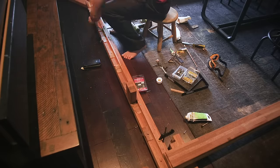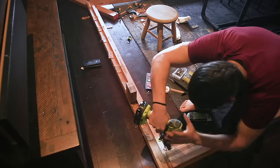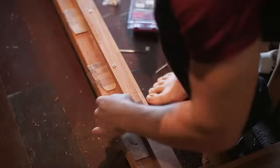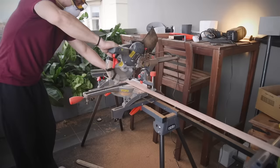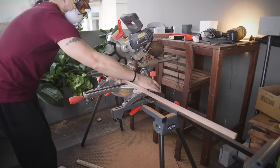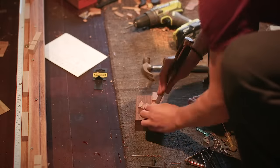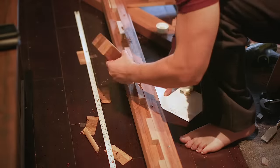I spaced out the screws so that each one was directly under a slat. I also put a few small angled brackets between the slats just to reinforce the join. The next step was to cut some spacers to position the slats evenly across the bed and to hold them in place. I had to chisel out a little gap in some of them to allow for the brackets I'd made earlier, and then glue them in place.